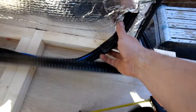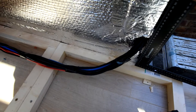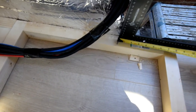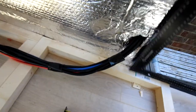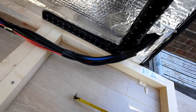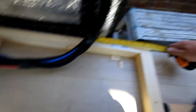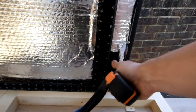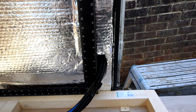Now we've got to cut a hole for a bundle of cables through the ply. I'm going to use a square just so that we know everything is where it's supposed to be. That gives us a measurement of 21 and a half for that side and 23 and a half for the other side, and six and a half inches going to the square up off the floor. Mark that out, cut it out of the wood and see how it fits.